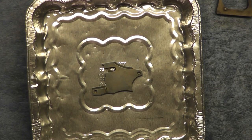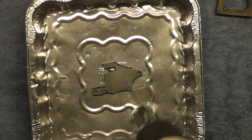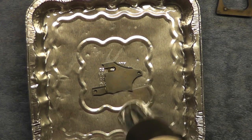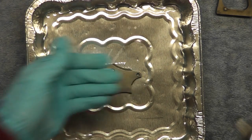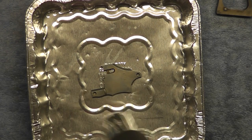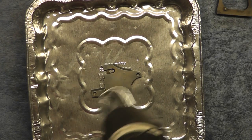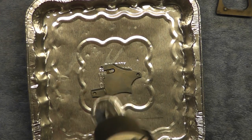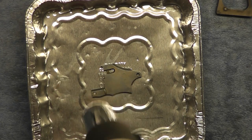One of the things is to heat it up, so I have a heat gun here. They don't say to heat it up in the instructions, but online it sounds like heating it up helps open the pores of the metal a little better — anywhere from 125 to 140 degrees, which is warm to touch. The instructions say: apply the Perma Blue with an applicator swab over the entire surface to be blued, work as quickly as you can, and you may want to divide it into two or three sections.